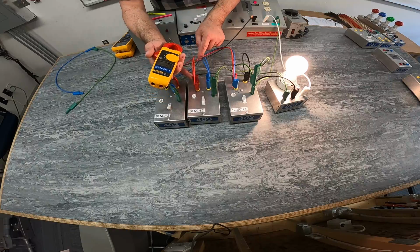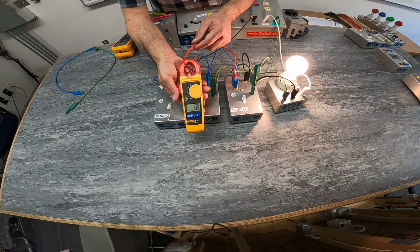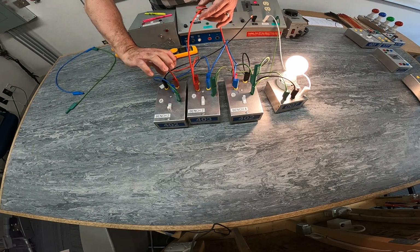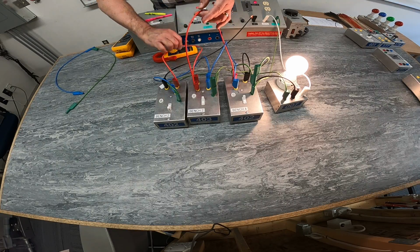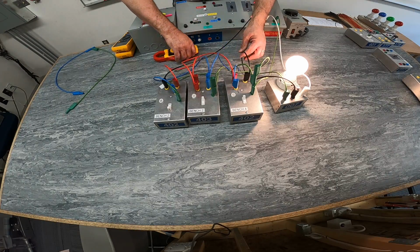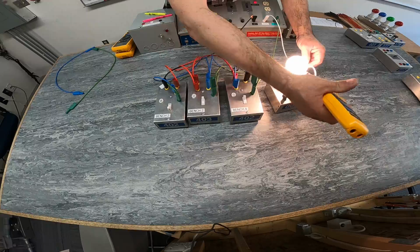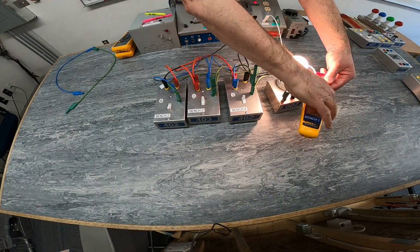So I have current at this point here now. I have current coming out of my red wire here. So I have current coming in on the black to here. It is now on this red wire from my three-way to four-way. From my four-way to my three-way is on this red wire. And then I have current again on my switch leg going to my light fixture, and I will have current on my identified going back to my power supply, being my bench.